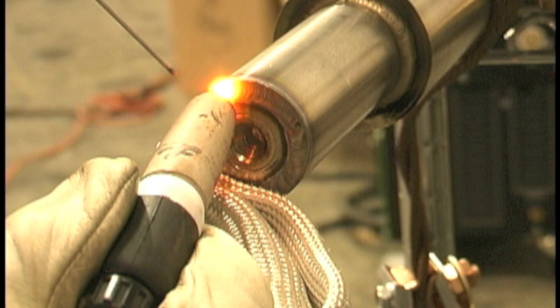For heavy aluminum out-of-position welds, it's great. For areas where there's just hardly anything to prop on, it's the bomb. There's just not always a ready place to prop and you can't always walk the cup — so that's when the TIG finger really excels.